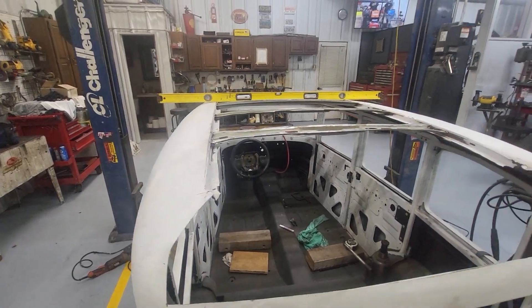At this point I've got that all scraped out and these all welded on. Now I'm going to orient and properly size my roof panel so that it sits in here with a slight gap so that the brazing can fall into there all the way around. We'll get her ready to go — that's the plan.